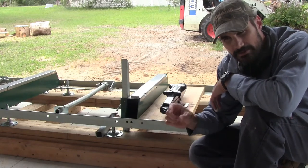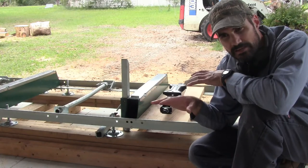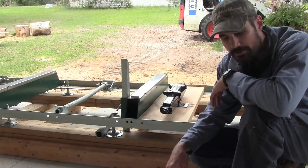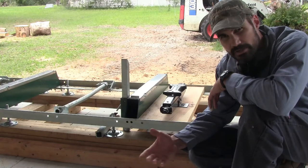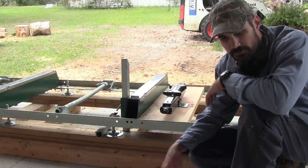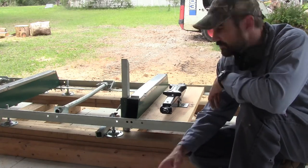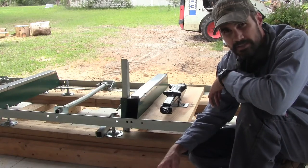But the pith there, it changes the way the lumber is. And so rather than trying to hit something right on the money, I just leave it and figure that someday I'll come back and I'll mill it to whatever dimension I ultimately want it to be. So you'll see a little bit more of that today, and you probably saw that yesterday. So I think we're all set up to go, and let's get some logs set up and we'll start milling.